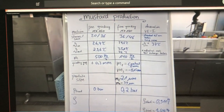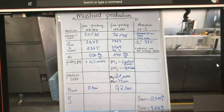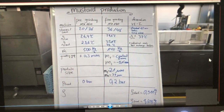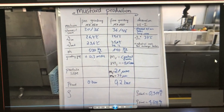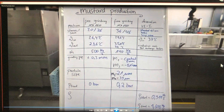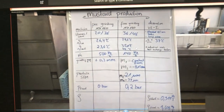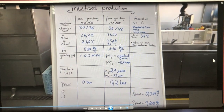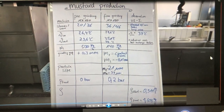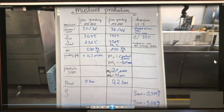A quick summary of the milling settings: pre-grinding was conducted on the MK160 with stones 20/36, inlet temperature around 26°C, outlet 3°C higher, throughput around 500 kg/h, grinding gap +0.3 mm, feed pressure around 0 bar. For fine grinding: inlet temperature around 30°C; at contact gap the outlet was 35°C; closing the gap further increased energy and we reached 38°C; throughput was around 140 kg/h. Particle sizes measured were 39 µm and 21 µm with the negative milling gap.